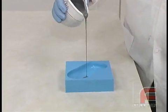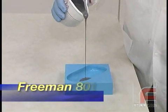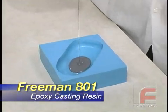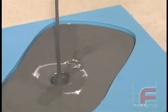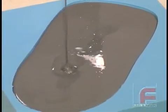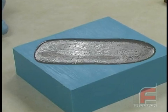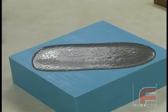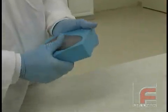To demonstrate pouring and demolding epoxy mass cast plastics, we're showing Freeman 801 epoxy casting resin. When pouring an epoxy mass cast material, it is important to pour in a narrow stream to eliminate bubbles. The aluminum filler used in Freeman 801 will create the separation of color that you will only see at the bottom of the pour. After allowing the material to cure overnight, you are ready to demold. Notice how many of the bubbles stay on the bottom — the thicker viscosity makes it less likely for the bubbles to rise, break, and self-level. However, the surface finish is outstanding.